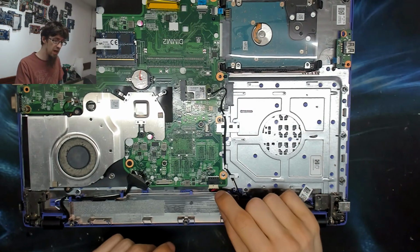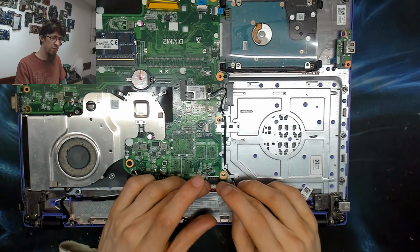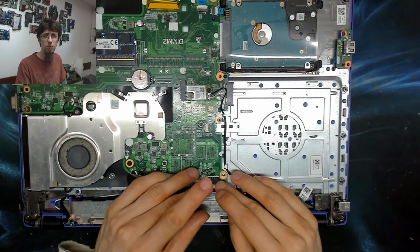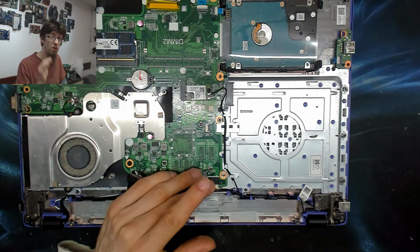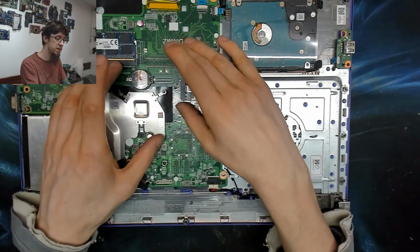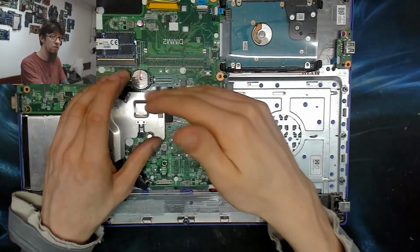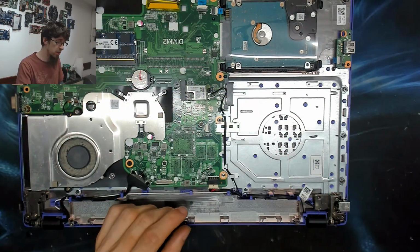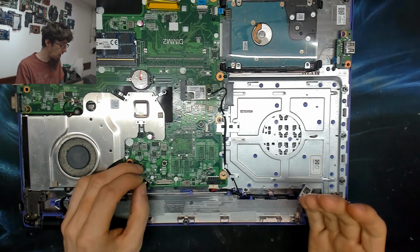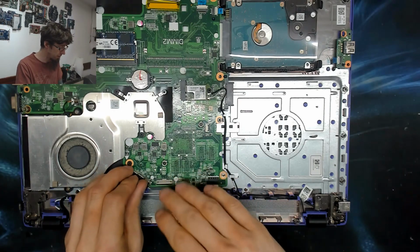If we had a low ohmage, like 20 ohms or 50 ohms or 100 ohms, but not kilo ohms, then that would imply that there could be a short circuit deeper inside the laptop on the other side of that inrush limiter. But this looks like a really obvious short circuit somewhere fundamental.